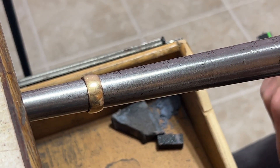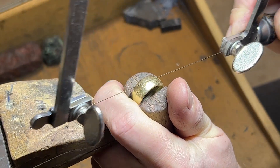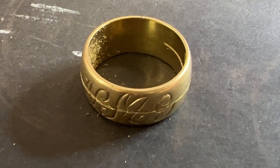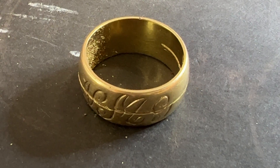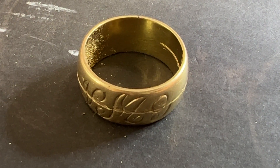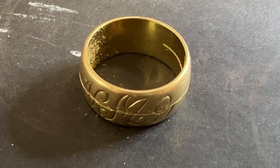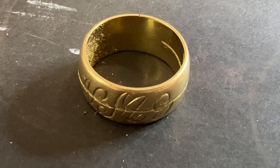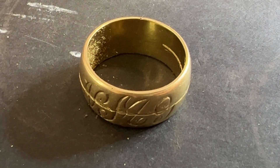We're going to cut into it and start turning this into two rings. We are in the process of separating the ring by cutting it in half. We did our scribe line, started sawing along the guide of the line, and now we're making our cuts deeper. The key trick to keeping everything even is to make sure your scribe lines at the start are good and that your saw blade does a nice shallow cut all the way around to keep everything straight, then go for a deeper cut. We're going to resume cutting, making it deeper, and then the rings will separate.